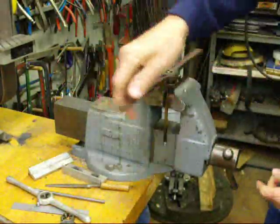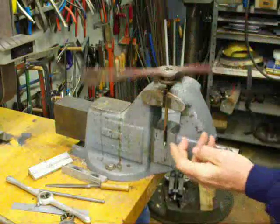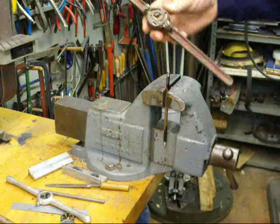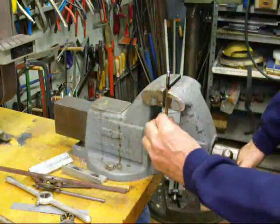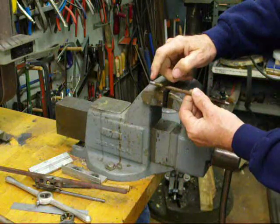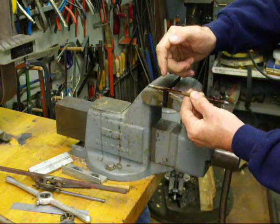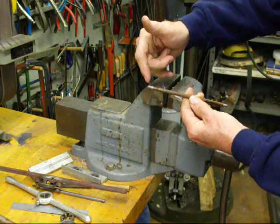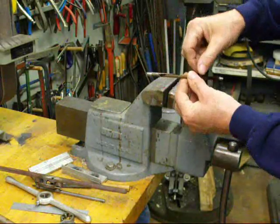I've just come flush there so now I'll back that off. That won't spin off because that little guide will hold it on. And there we've got a very nice quarter-inch twenty-eight fine thread and we know it's on there perfectly straight. It looks like there's no chips out of there, no broken teeth, so that's a nice thread.